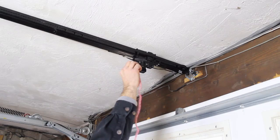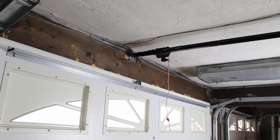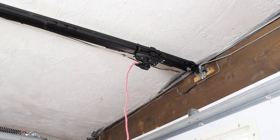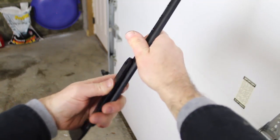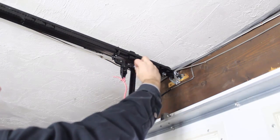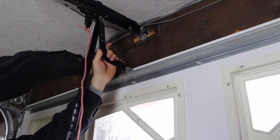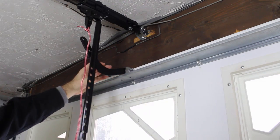Slide the emergency release rope through the trolley and make sure that the right handle is facing the correct way — there is a correct way for how it should be facing, but that's pretty simple. There should be a support bracket on your garage door. Make sure that your garage door is totally down and flush with the floor. Pull it down on the emergency release rope. There are two brackets that come with the garage door opener — a straight one and a curved one. Install the straight bracket first into the trolley using a clevis pin and ring fastener. Then attach the curved arm to the bracket on your garage door using a clevis pin and ring fastener.